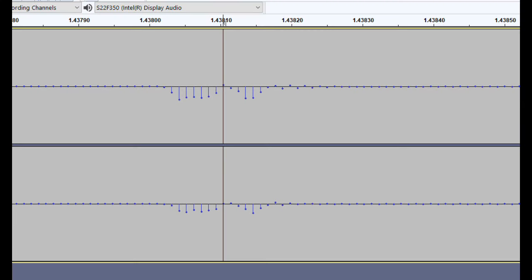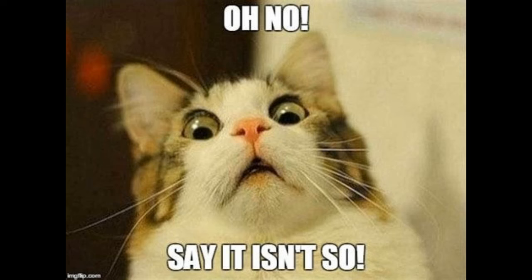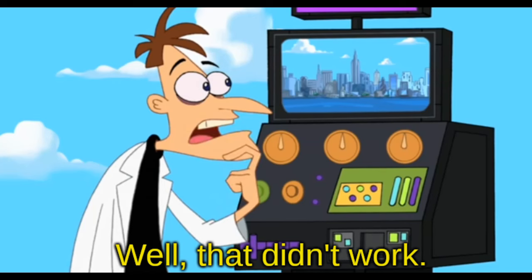The MIDI Man's delay is around one sample, 10 microseconds. So that's just some electrical delay, because I opened it up and checked, and yeah, indeed, it's just an optical isolation and a hex buffer. So that was stable, wouldn't affect my measurements. So I decided the MIDI Man would be excellent to get rid of the ground loop problem. But then it turns out it's not happy with 3.3 volt MIDI equipment. And two of my MIDI interfaces are indeed 3.3 volts. So I don't want to measure some things through the MIDI Man and other things not. So yeah, that also did not work.